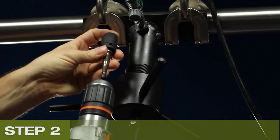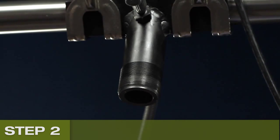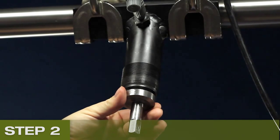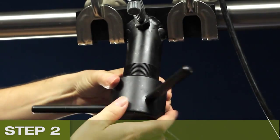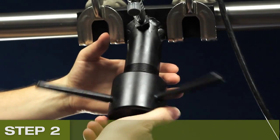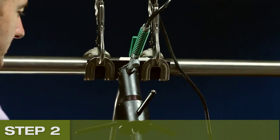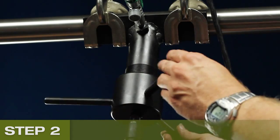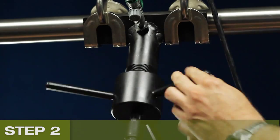Attach the driver socket to the drill and ensure the drill bit and jig are free from swarf and dirt. Insert the 15 mm drill bit gently to avoid damaging the bit. Screw the drive nut onto the jig, continuing to screw gently until it stops, then back off half a turn. Attach the drill, release the coolant supply valve, start the drill, and tighten the driver nut, making sure the pressure is steady and continuous — otherwise the drill could polish and work-harden the steel as it turns.